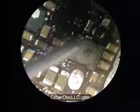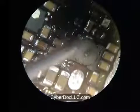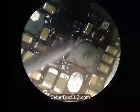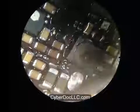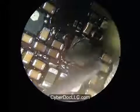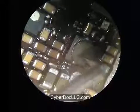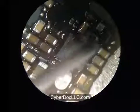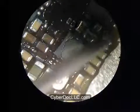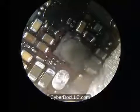And just move the component around. You want to get a little bit of shear stress onto the joints, so the bond forms better. You want a good connection between the solder and the copper connections on the components. And that's it, this is pretty much down soldering. In the video, I'm just moving things around to get the joints perfect. I don't want any cracked solder joints.